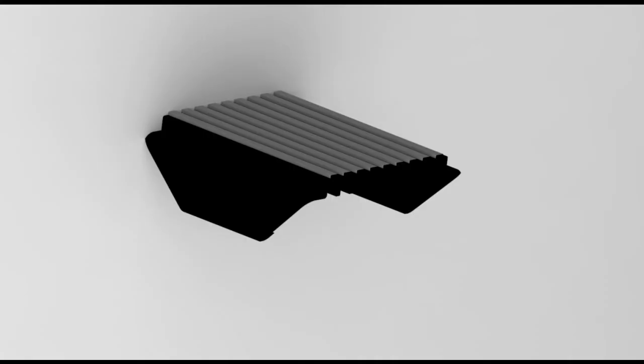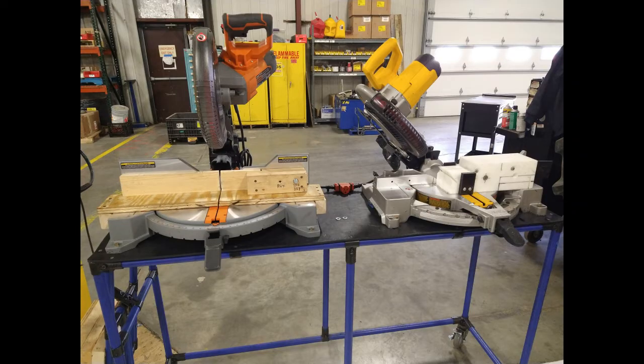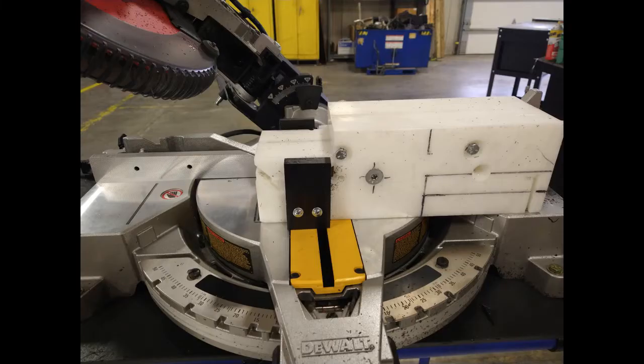These spacer clips are formed from a 4-foot long piece of extruded PVC cut into 4-inch sections and given a 45-degree angle on each side. Currently, Assembly Systems uses a series of 2 different chop saws to complete the cuts. This process is potentially hazardous, and currently only 1 person is able to operate it.